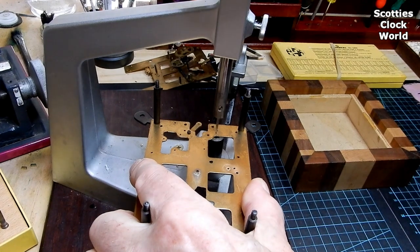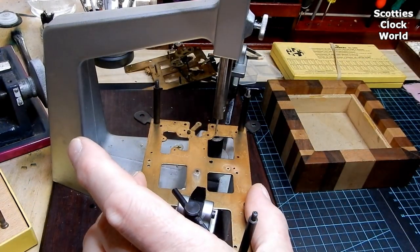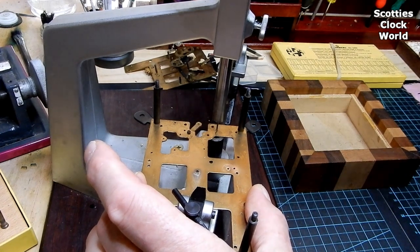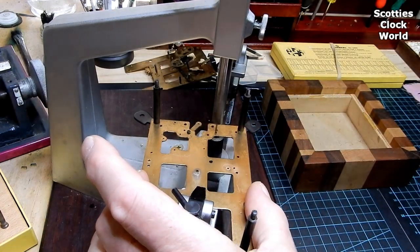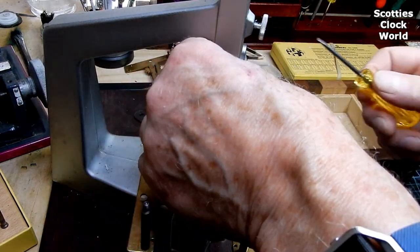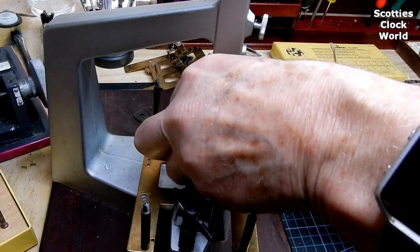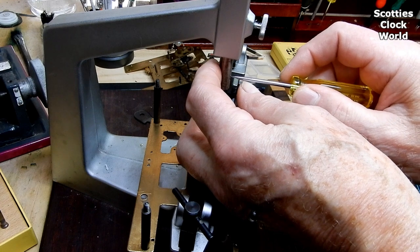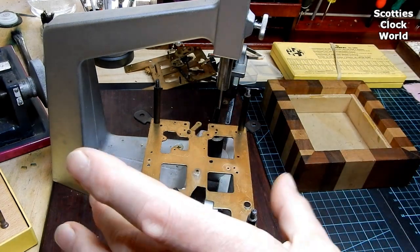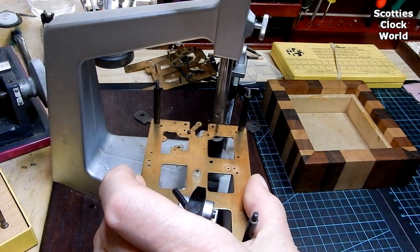Keeping the plate in place so it doesn't move. From time to time, lift the reamer, clean away the material that you've cut, and start again. That's the second reamer. We now want the 2.50 size hole, and this reamer is 2.47. So that will make a nice tight fit when we hammer the bush into place.